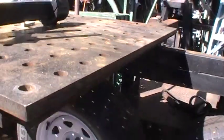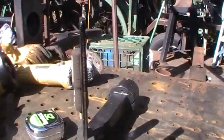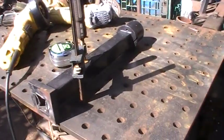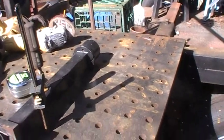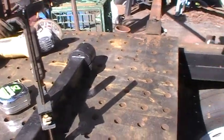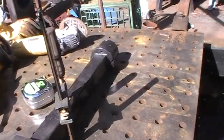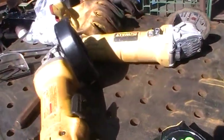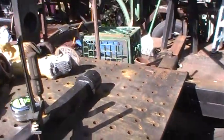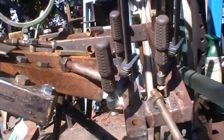I really watched a lot of YouTube videos with all the fixture tables and how people were doing them, and I noticed that almost every one of them stacked their fixtures on one corner of the fixture table. I got probably the smallest one they made — two feet by three feet. But I went with a half inch plate because Harbor Freight sells one that's either eighth inch or three sixteenths, and they make them up to quarter. But let me tell you, if you're going to get one of these things, you want to make it usable — half inch is the way to go.